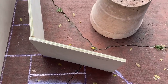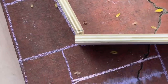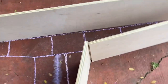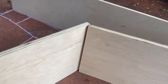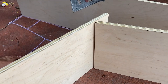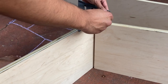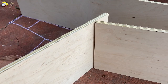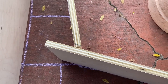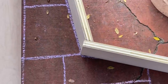I want to cut these kind of miters as I go — there's a better way of doing this, but here's how I'm doing it. I want this board to be cut so it sits flush on top of the back. What I'm doing is scooting this board forward a little bit, getting my square, catching the end of the board back to the corner, drawing a line, and hoping that gets me close. I went and cut that on my table saw — I feel pretty good about that angle.